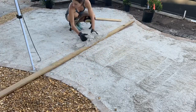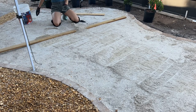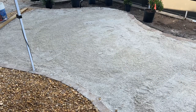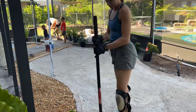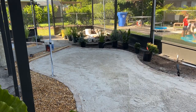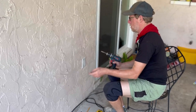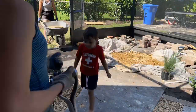We used a long piece of lumber to help level things out, leaving a slight dome in the middle, just trying to get everything perfectly smooth and compacted. We had already compacted it a few times and watered it down, which helps sink it down a bit more. The clips of me leveling with this hand compactor are hilarious because it looks like I'm waddling like a penguin. What I'm doing is lifting it a few inches off the ground and letting it go — when it hits the sand it vibrates and helps compact things. You want to make sure you're not holding on while it's vibrating because that can stress your back. Meanwhile, my dad was installing the outdoor transformer to convert to low voltage and allow us to control those lights from our phone on a schedule.